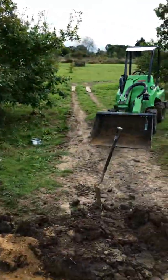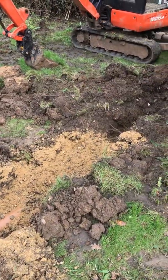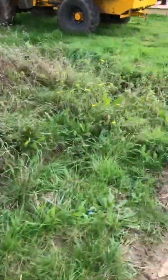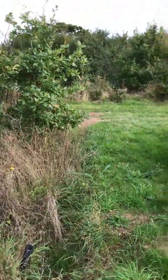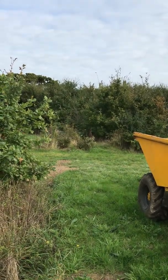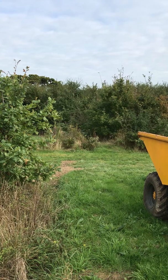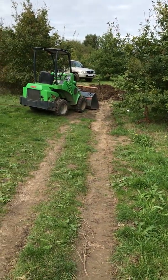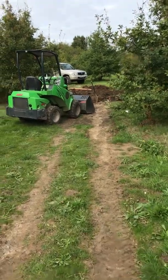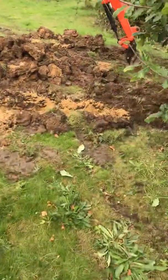This is actually clean enough to discharge into a ditch over there, so at some point if it doesn't work with the shallow drainage and we get effluent bubbling up, we will run a catchment pipe all the way across the back to pick up into that ditch. I don't want to use the ditch because the neighbour has got a big pond over there, and the last thing I want is any products from sewage — even at 0.02 or whatever — ending up in his pond where it collects and may fester over the summer. So even though it's theoretically clean enough to discharge into a river or ditch and that's what it's certified for, we're basically going to try and lose it in the ground.